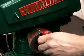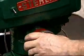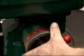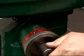To adjust the drill point angle, release the hand wheel clamp, adjust the tilt hand wheel to the desired drill point angle, and lock the hand wheel clamp into position.